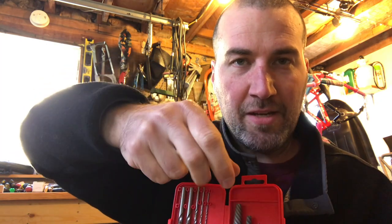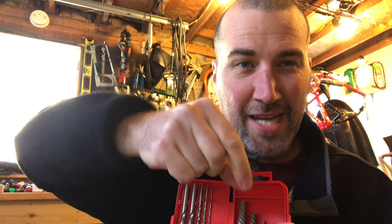Don't put the extractors in your drill chuck and try to reverse-drill it out — it's too fast. Instead of grabbing cleanly it'll just grab a tiny bit, strip it away, and bore out your hole. Do this by hand. I've got a quick video of me running this on the cabinet door — we'll cut to that and you can see some live action footage.